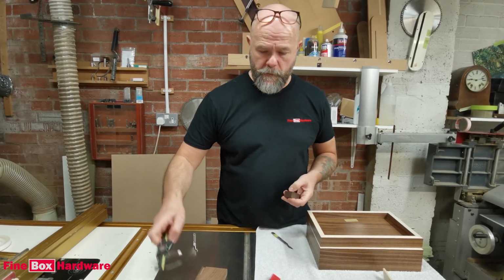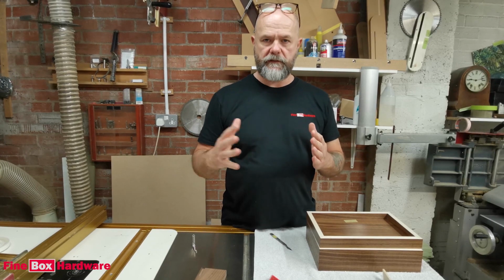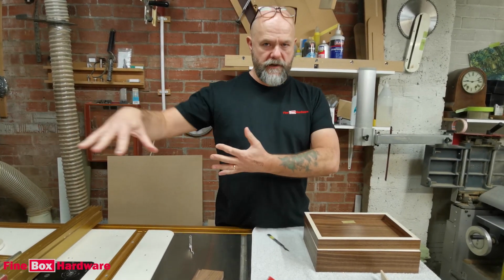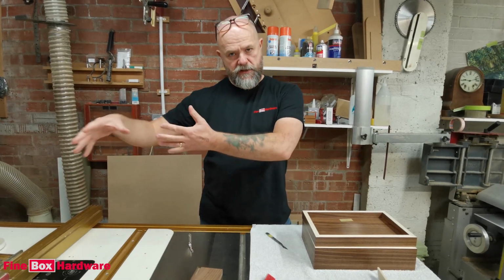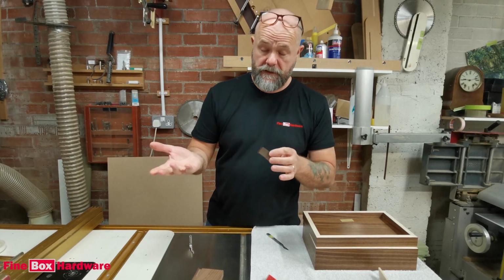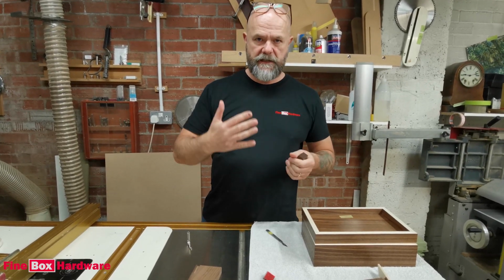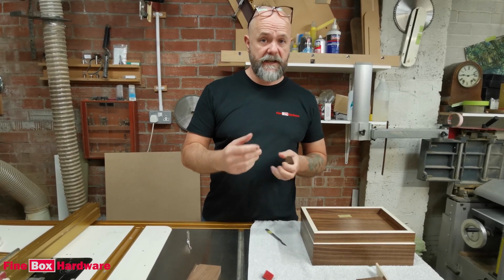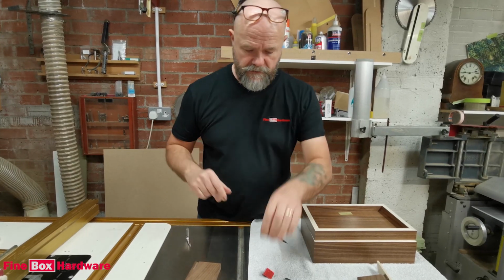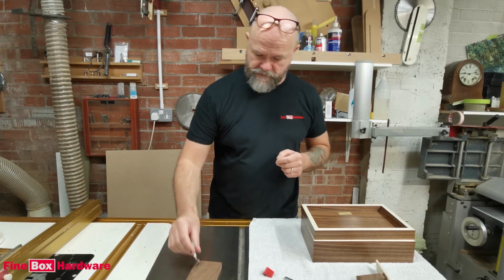That's the length. Okay, so the misalignment that people are having really happens when you go to do your next set of cuts. You're resetting your stop. Even if you use the plastic block, which we will use, you're climb cutting. You're going with the rotation. It tends to pull you in. It can actually produce a slightly longer cut. But I'm going to show you very shortly how to get more accurate results.